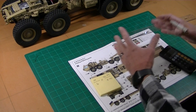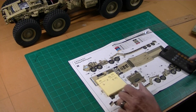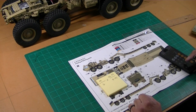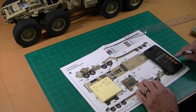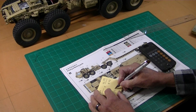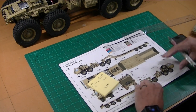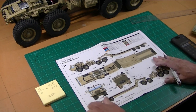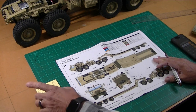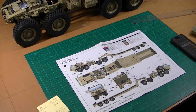That means I need to enlarge this drawing to get a full-size version. I'll take 42.29 divided by 8.75 and I have to enlarge the drawing 4.83 times. I'm going to run down to the office supply store and have them make an enlargement — I'll probably enlarge it five times just to make it simple on them.